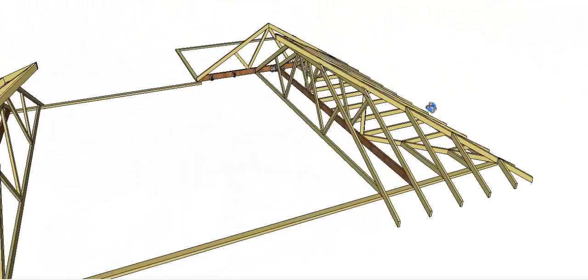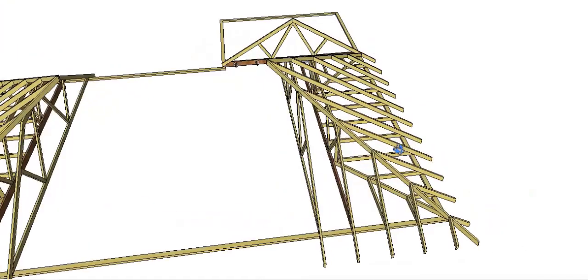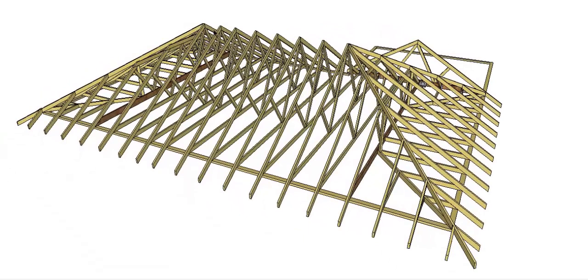So I've got my hip end all tapped into place. What I would then do is put up a string line from the apex on this end to the apex on here, and that would allow me to line up all my common trusses — straighten through to line up all the apexes. You can also line them up off your wall plates if you know your walls are straight. You need to be temporarily bracing all this as you go. A good trick is to use a piece of speed brace along the top of the trusses — that holds the top into place. You could also be putting in your lateral braces as you go, or using temporary pieces of timber across the top of the trusses.